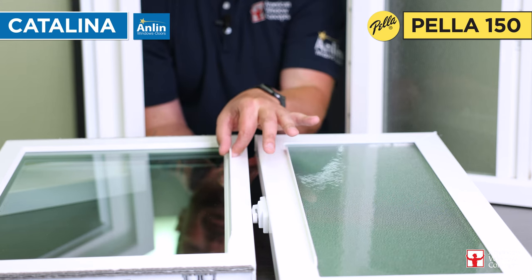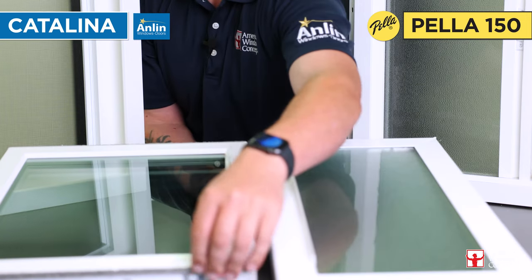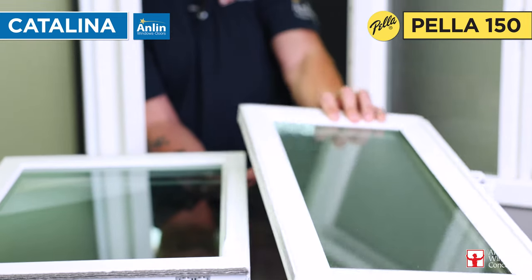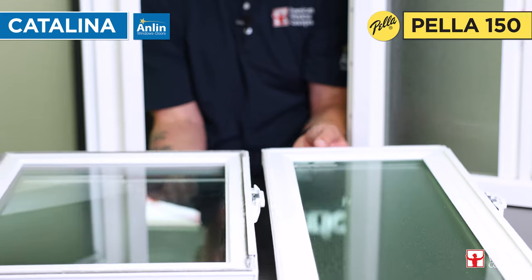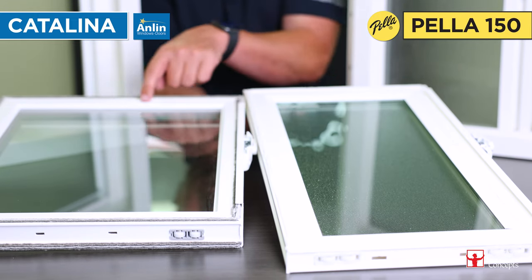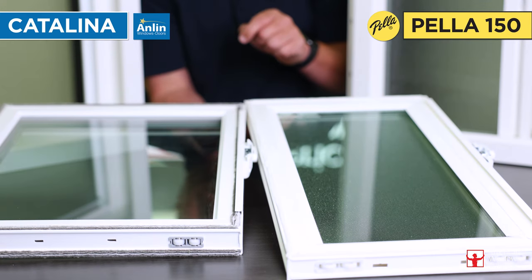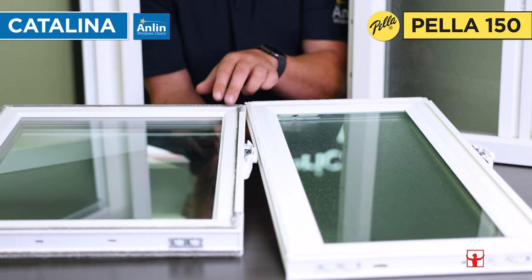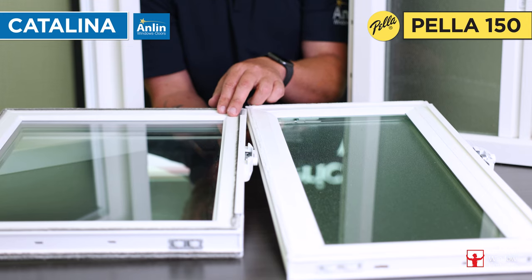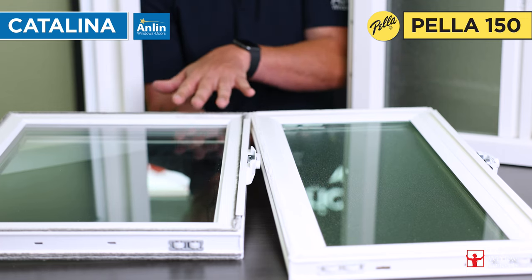Look at how small this pull rail is — and look at how much bigger this one is. The weather stripping: there's no weather stripping on the bottom or on the sides of this one, where this one does have it. Plus, if we flip these over — so we've flipped these windows over — let's take a look at the glazing beads. Here is a premium line snapping glazing bead with dual durometer. The job of the dual durometer is to help keep water away from going inside the dual pane glass unit. It's not going to stop it, but it helps. And it gives it a nice clean look — you can see the difference between an entry and a more packaged-up window.